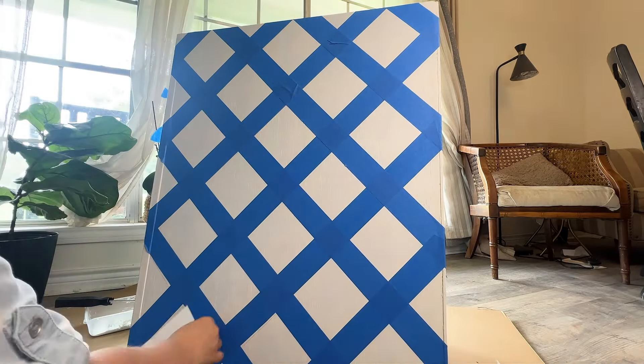I just took my box cutting knife and pulled that tape off. You can see why it was a bad choice — some areas had more paint and some had less, but with a second coat that color is looking so much better. Here's a tip: if you have to take a break, wrap up your roller and cover your piece with cling wrap. Press and Seal is definitely a favorite.